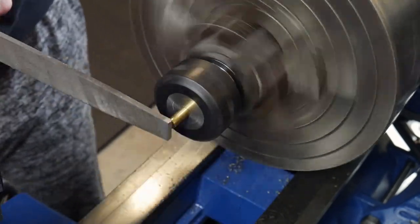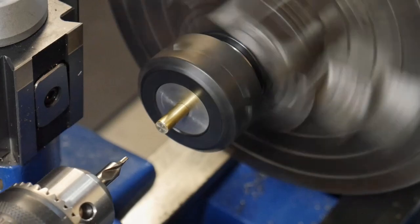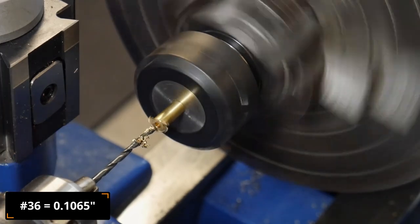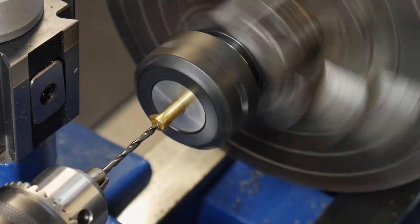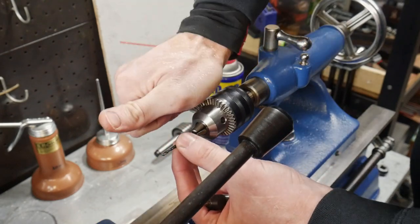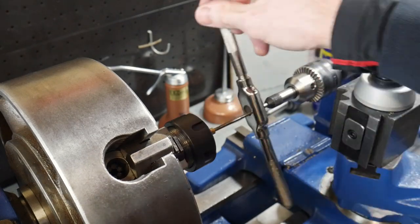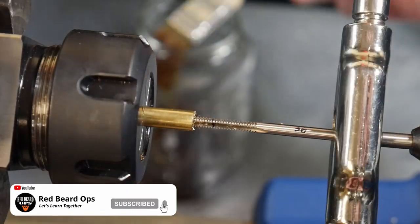The first step is to face off this piece of quarter-inch bar stock and then drill a hole in the center of it. I'm using my center drill just to get the hole started, and then I'll continue drilling with a number 36 drill bit — this is the appropriate pilot hole to tap a 6-32 thread. We'll be drilling this hole around one inch deep so we can produce two Loveless nuts with one drilling operation. Once we complete the number 36 hole, we'll install a tap follower into the tail stock to hold the tap nice and straight and apply even spring tension. This was fairly easy working with brass — stainless steel would take significantly longer.